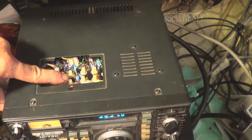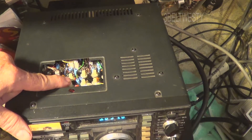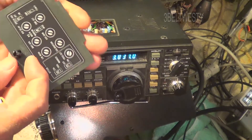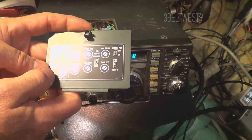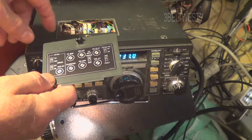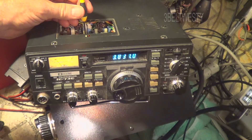There's a pot over here with the cover off — it's the closest one toward the meter, and that's the frequency adjust. I'm going to tweak that while they're talking to make it sound correct. The little cover comes off, and it's got a little doodad there with the different settings marked.